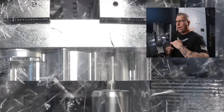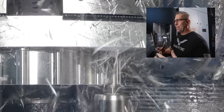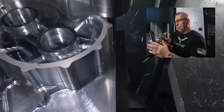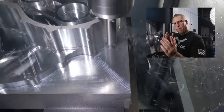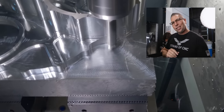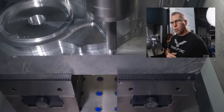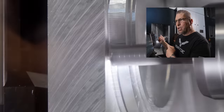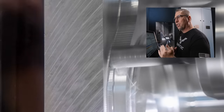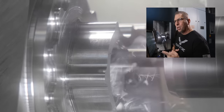Get the material out — straight MRR, aggression — and then we come back, drop the spindle speed, come in at like 8,000 to get rid of a little bit of vibration. You've got a five-flute tool and we come back and just kiss the baby right into spec. I left about 30 thousandths on all walls, which is great for this tool. It's a three-quarter inch end mill and it'll give it a nice surface finish. It'll have a little bit of pressure on it, which will keep it from vibrating.